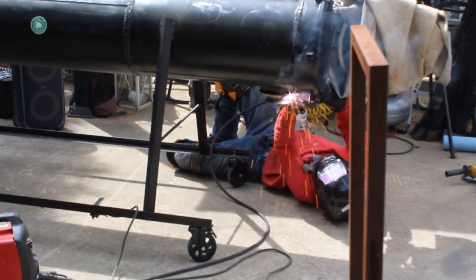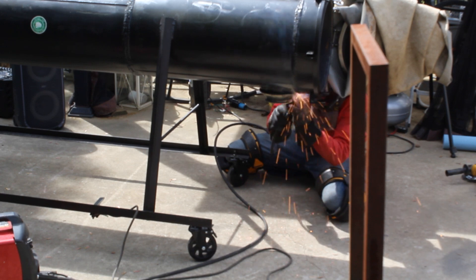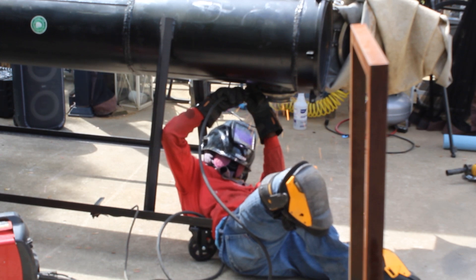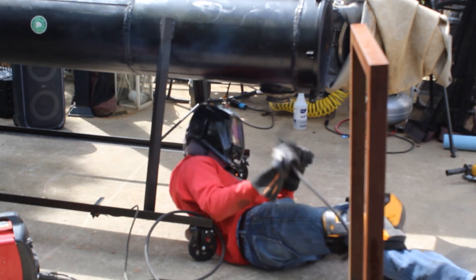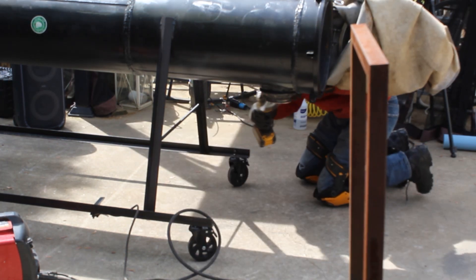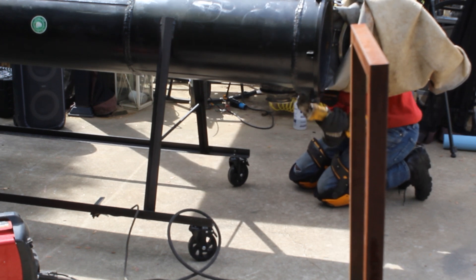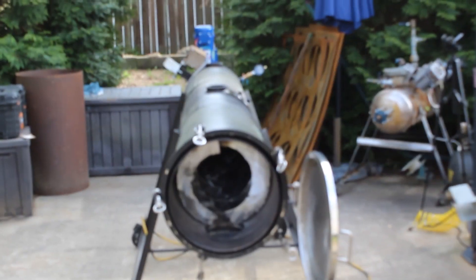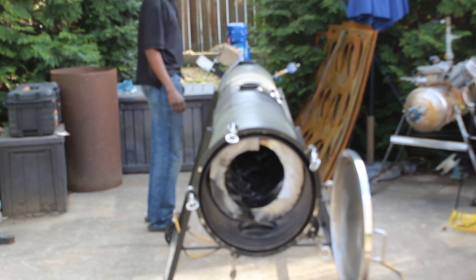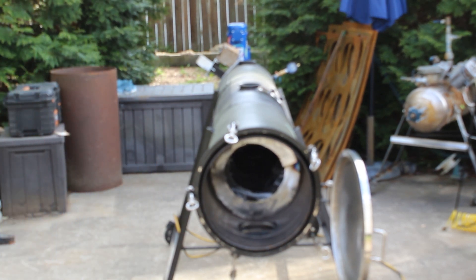So I had to modify some stuff — I had to hand-fabricate a cone and weld on a four-inch tri-clamp fitting, essentially making my own tri-clamp cone. I looked online and a six-inch to four-inch cone was like a hundred-something dollars, and that's just not in the budget for a simple piece. So I built it myself to go from six inches to four inches. My six-inch tri-clamp flange on the reactor also got warped badly — it was not creating a seal at all. I had to get up under there and weld it overhead, but it worked out fine.